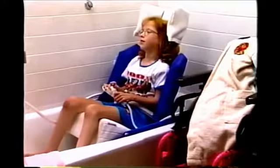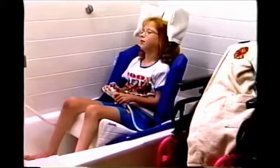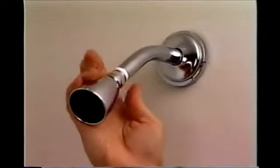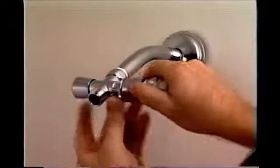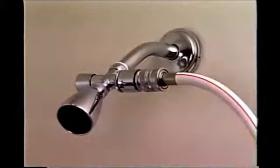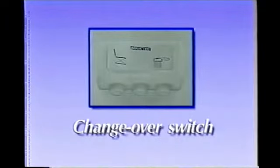With the following accessories, you never lose the function of your tub or shower while maintaining independence and dignity. If you have a tub-shower combination and you want to use your shower head, a diverter valve can be mounted. The lift supply line and shower head or handheld shower can be hooked up to the diverter valve. For those who cannot reach up to the shower pipe, a diverter-type valve called a changeover can be mounted next to the bather to give a choice between operating the lift or using a hand shower.